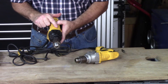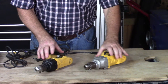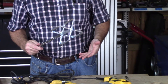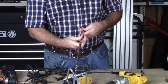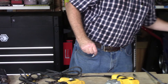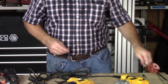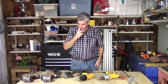So if you're just looking for one drill, I would look for a half-inch with the hammer feature. I like these because they're a bit more powerful — say I'm mixing mud for sheetrock, mixing paint, or mixing mortar for tile work. I can use a paddle bit. For a small bucket of paint, I'll often just use a little stir attachment, which is a lot more handy than a wooden stick, although I still use those too.